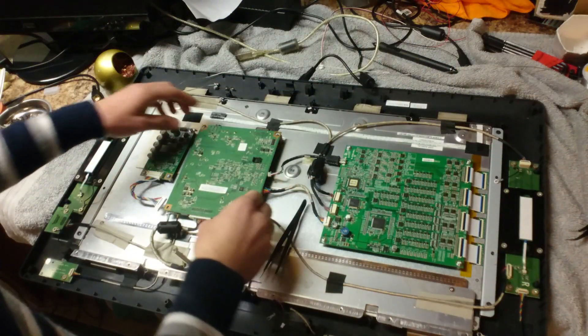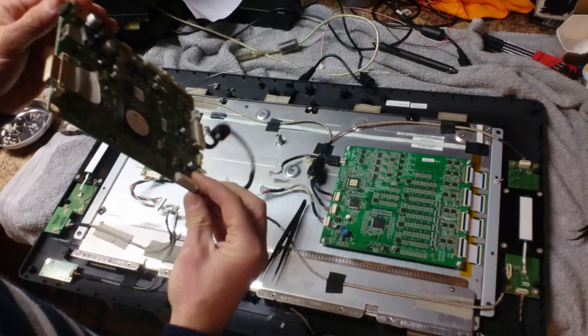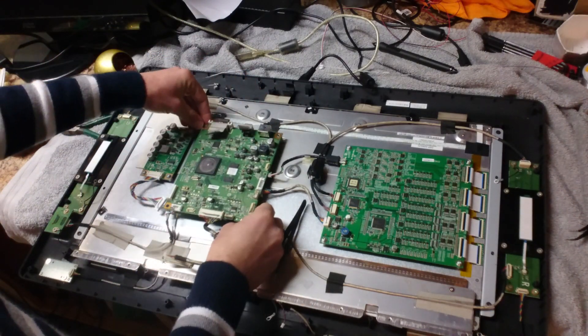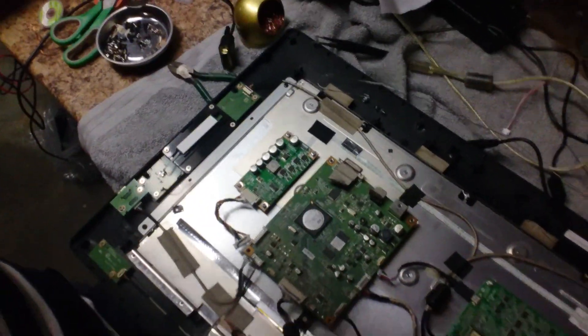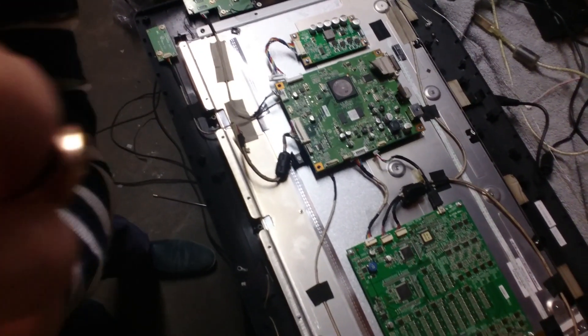The board's already heated up a little bit. It's a three-layer board — that's why it takes so long to heat up, because it's got three or four layers of copper that have to warm up. That can be pretty heat-absorbing — a pretty good internal heat sink. Alright, let's get a better position so you can follow this a little better this time around.